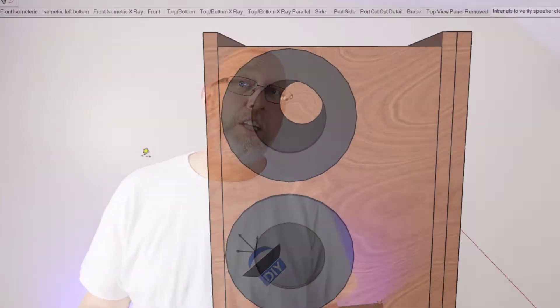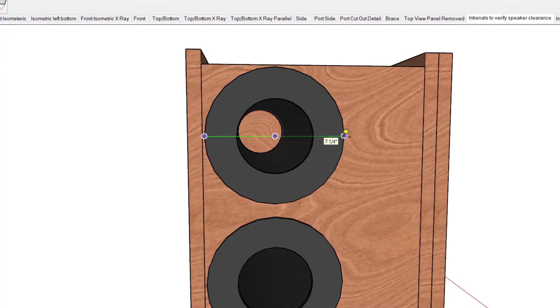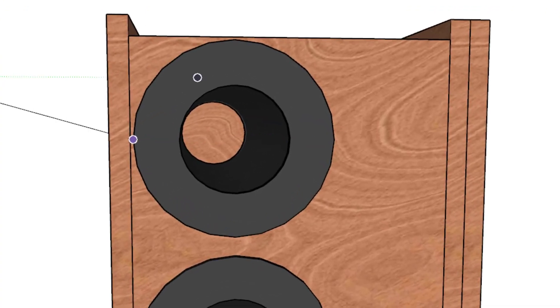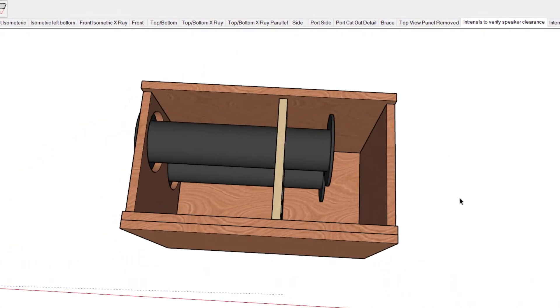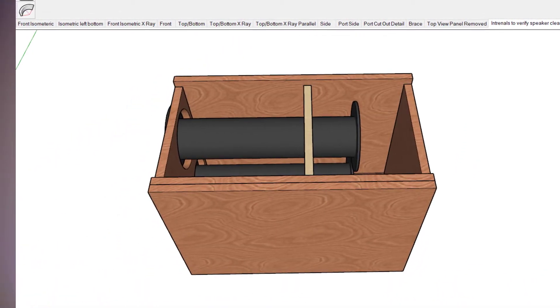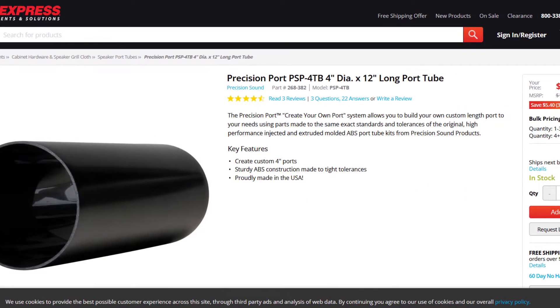When you're designing and building the enclosure, you've got to pay very close attention to the overall outside diameter of these ports. These flares are actually pretty big. For a four inch aero port, the overall outside diameter of the flare is seven and a quarter inches, and you'll need a six and a quarter inch cutout. After modeling the enclosure in WinISD and verifying the port length using the precision port website, I found that a full 18 inch piece is going to get me really close to my tuning frequency, so I'm just going to use a full 18 inch piece. But if you need to shorten yours, it's just a matter of cutting the 12 inch piece down to the right size. And if your port needs to be longer, you can buy additional pieces and couplings to get any length that you want.